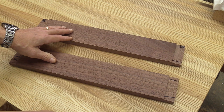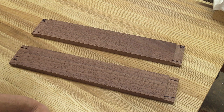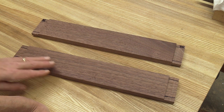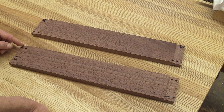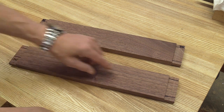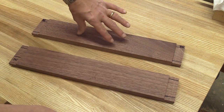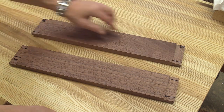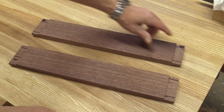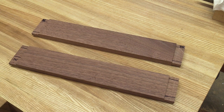I have a pair of side rails — this is the lower, this is the upper. I've made some marks so I don't get confused because there are several different things that have to happen. On the bottom rail toward the front I need to cut off a full inch and 3/8 inch down leaving that part as the tenon. On the back it's 3/8 and 3/8 all the way to the shoulder. The top piece uses haunched mortises which require haunched tenons — I'm taking 3/8 inch off the bottom and then 3/8 inch up to a point on each side to fit the mortises correctly.